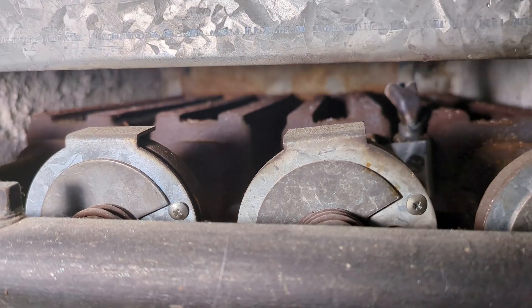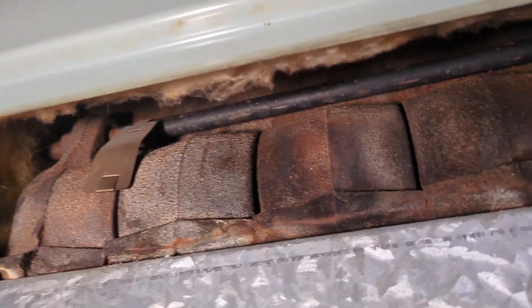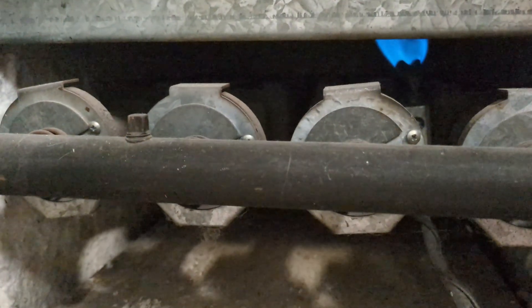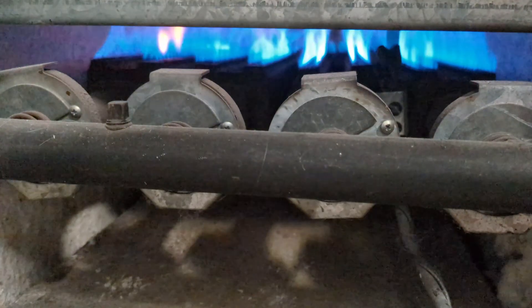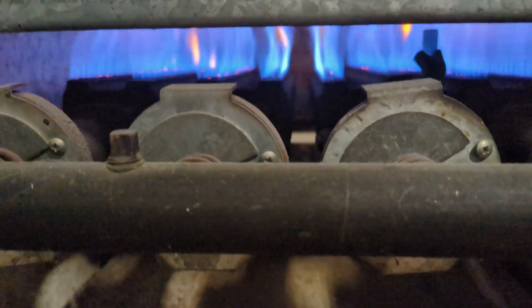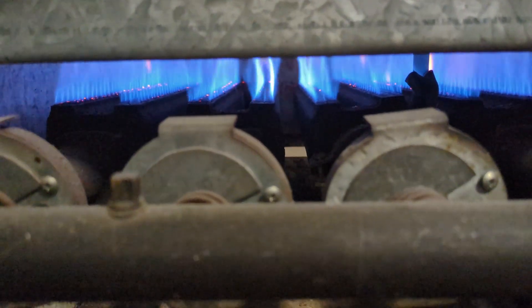You can also tell when the burners are on whether they're dirty — you'll see some red glowing bits of rusty debris that needs to be cleaned off. You can see the bottom of the cast iron boiler, which is very similar to those old-fashioned steam radiators, built in sections and bolted together. The thermostat called for heat, so the burners start up and turn on high. You can tell the burners are a little bit dirty from those burning red metal flakes on top — it's really just rust falling from the boiler above.